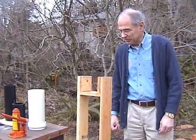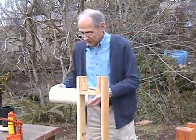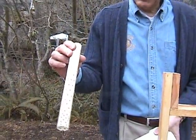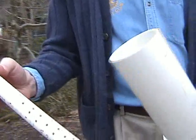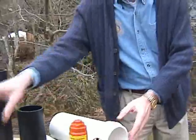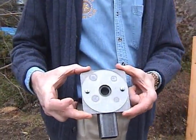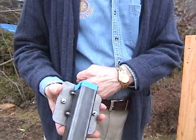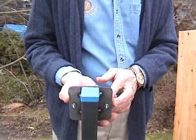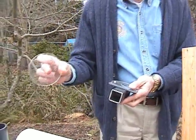The next thing that Bob has also been working on is — we quickly learned that having to drill the holes in the PVC was very, very hard. So he said, why not have the outer PVC solid without any holes, and instead use a PVC center pipe which you've drilled? We went through a couple of versions with a wooden base and saw that you just really can't drain the water that you need to. So the latest one we're going to be working with today is a metal base. This has a piece of channel stock on the bottom, a square piece of metal on top, and four spot welds on the bottom to hold it together. It's offset so that the water runs out, and on the back you can put a plug or just a piece of tape to keep the water from coming out. Our washers are acrylic.